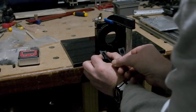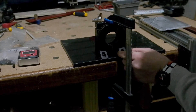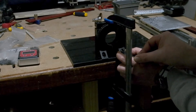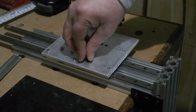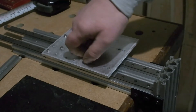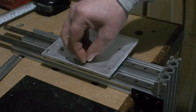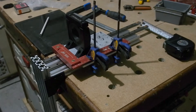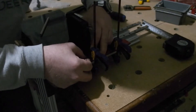You may recognise this as an OpenBuilds motor mount - it comes with a number of pre-tapped M5 mounting holes. I'm using two on the top and bottom with good quality corner brackets, set in place on a flat granite reference. It was after preparing the motor mount that I realised drilling through-holes in the plate wasn't going to work - no room for nuts on the other side. Thankfully I'd left enough room on the plate to drill and tap another four holes for the mount.